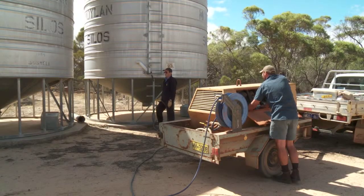You should pressure test your silo annually. There's always a chance the rubber can be damaged. Grain under the rubber upstairs is quite a common one, as is folded rubber. The big one for Western Australia especially is leaving the seal plates underneath the silo where the parrots eat it.